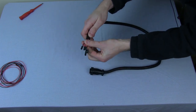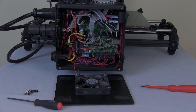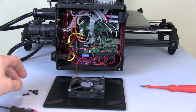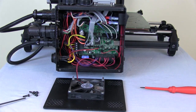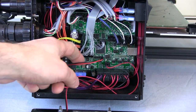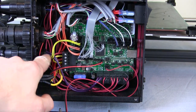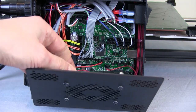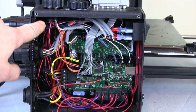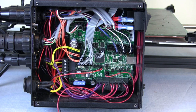I've got those sticking out where they connect to the actual hotend, and that goes to the printer. Let's open up the electronics box. I've taken the cover off — it's four screws, which come off with the appropriate long spot screwdriver. I've attached the corresponding wires inside here, as documented in the instructions, and I've tucked that cable away so it doesn't get tangled in the fan when I put it back on. That goes into pins 5 and 6 again in the connector — those just push in — and that's documented in the hardware assembly guide.